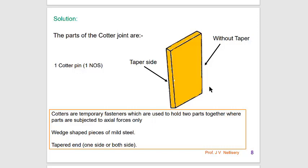The other reason is that due to the taper shape, it is easy to remove the Cotter and dismantle the joint. The taper of the Cotter as well as the slot is on one side. Machining taper on two sides of a machine part is more difficult than making taper on one side, and there is no specific advantage of taper on both sides. The clearance between the taper and the slot is 1.5 to 3 mm.